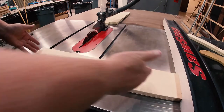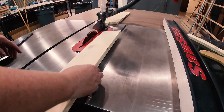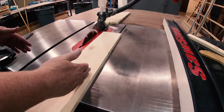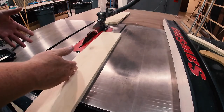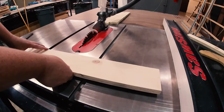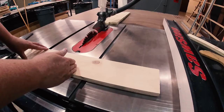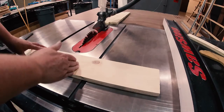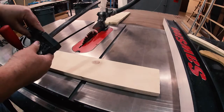Because of that, we start to think about the size and shape of the wood. Wood oriented this way is like a ripping action in solid lumber, so I'm going to consider it ripping and I will use the ripping fence. When I turn the wood 90 degrees, I'm now doing a cross-cutting action similar to what I would do with the radial arm saw or the miter saw, so I will want to use the miter gauge.